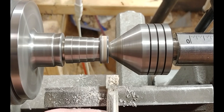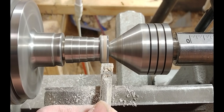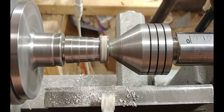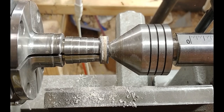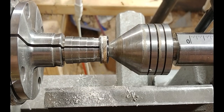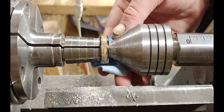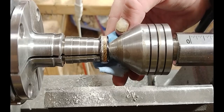I'm not showing the Illuma UV finishing process in this video — I have other videos on YouTube that cover that. One thing I noticed about the ceramic core: nothing scratches it. I went right up to it with my carbide tools, took a razor blade to it to clean up the CA that spilled onto the edges, and it looks like it came right out of the bag — no scratches whatsoever. Didn't have to sand, didn't have to refinish it. Really neat material. And that's it — all shaped up. I'm just going to clean it up with some denatured alcohol, wipe off the dust, and see what the grain looks like. I'm really happy with the way this one turned out.